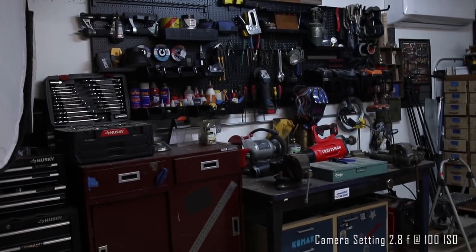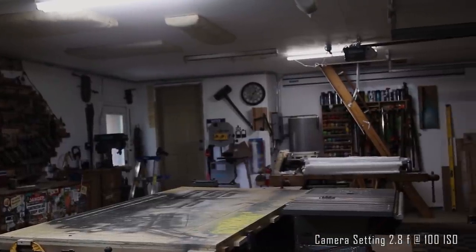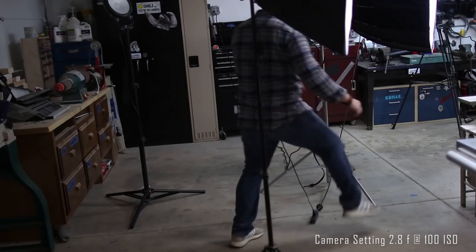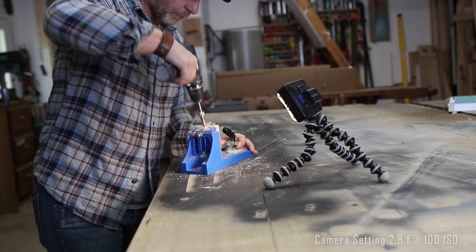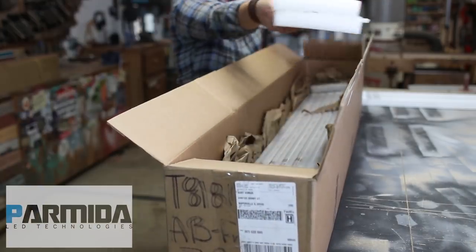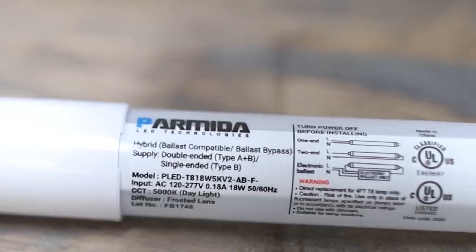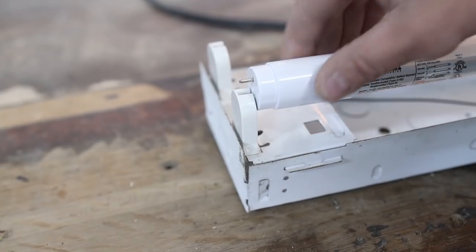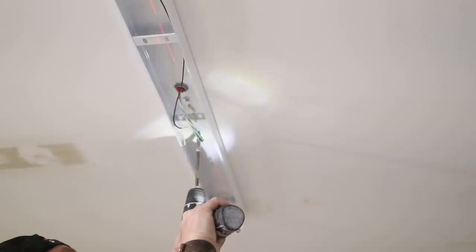If you're anything like me, your workspace is in dire need of additional lighting. Even though I have six fluorescent lights, it still seems like it's always dark and I'm always compensating with additional lighting, setting them up, walking around them and I'm even using small key lights to help with projects. So to fix this problem, I partnered with Parmita LED Technologies and they set me up with two different types of LED bulbs, a hybrid bypass bulb and a direct replacement bulb. So today, I'm going to show you guys three different conversion methods: a plug and play, a ballast bypass, and a direct wiring method to add new light fixtures.